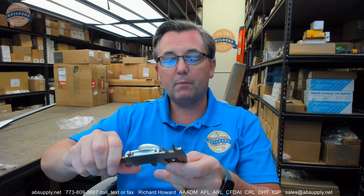So how to go about installing this. If you're just swapping one out, we'll look at the template in a moment. If you're doing a new installation, it's really simple and straightforward. Having a caliper is the second most important tool to the woodworker, with the router probably being first. I like to put my caliper on it — they say three-quarter inch, but it's actually .752; two thousandths of an inch matter. It's really nice to know what you're prepping before you start cutting something that may not be easy to reverse.